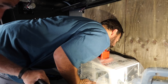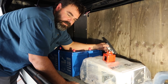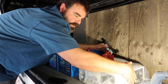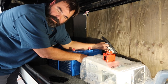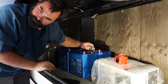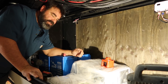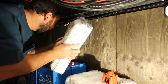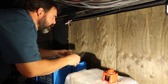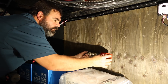We need to check the inverter specs to make sure there's enough room for venting if we put a shelf nearby. The main vents are on the back and front sides, and it has an internal fan — we're going to have about three inches there. We're trying to determine the layout of all the different switches and controls. We're going to put the solar controller up on the wall right about here, the T-fuse will go here, the negative ground bus bar will go down below, and the off-on switch will go right about there.